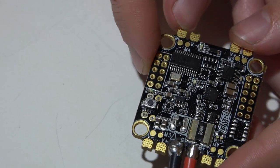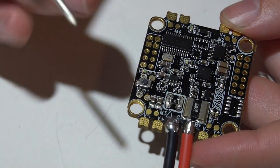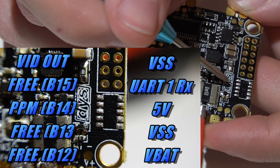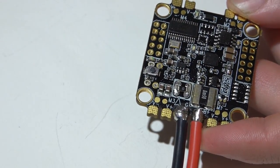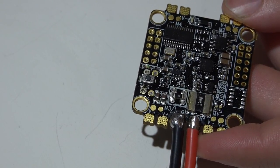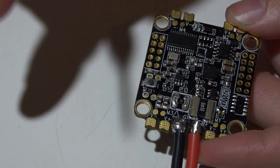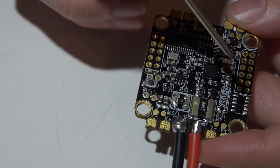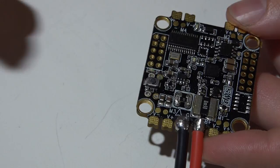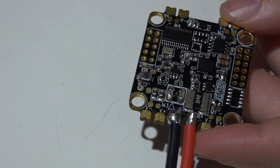If you're using a PPM receiver, there is no dedicated pad for PPM, but you can still use it. I'll flash a picture of the pin-out for that set of pads — on the left side in the middle is the pad for PPM, and I can confirm it works with Turnigy/FlySky and FrSky receivers. If you're using the Turnigy Evolution or any other Turnigy transmitter, IBUS works on all three UARTs. IBUS is better than SBUS anyway, so just pick any UART receive pin, switch to IBUS, and you'll be fine.